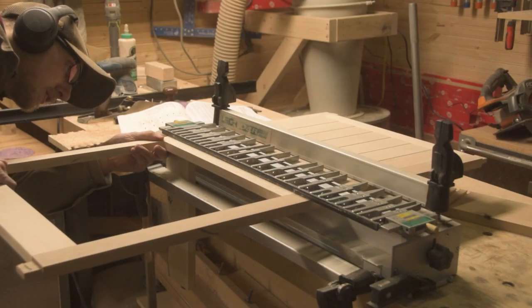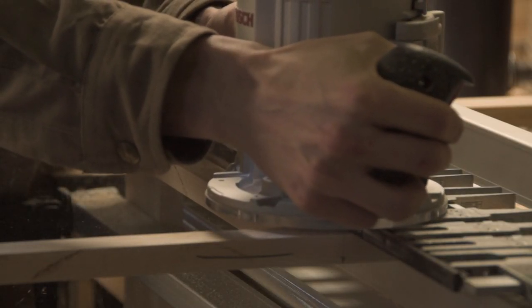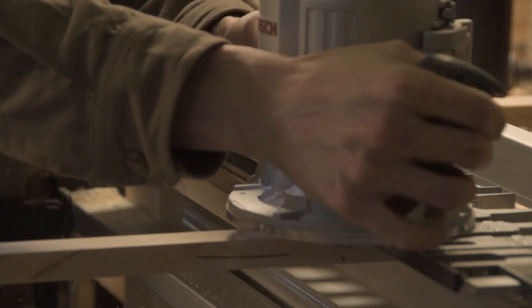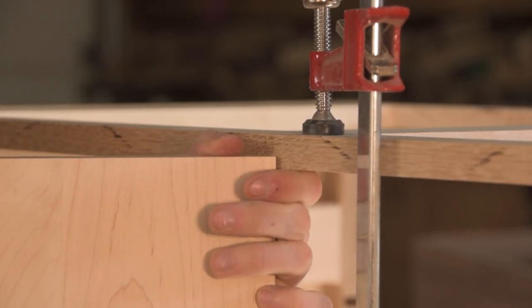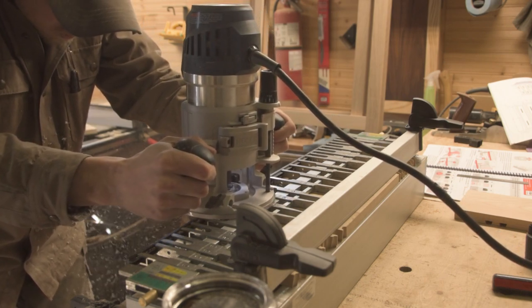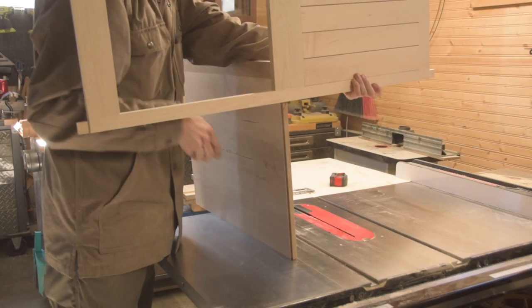It does have the benefit that it doesn't allow these pieces to be pulled apart, for gravity to separate them, anything like that. Now I will say that using this dovetail bit did lead to some tearout, which you will see in the final shots, in areas that I had to do some fixes on. But overall, if I was going to do this project again, I would still use the sliding dovetails because I think that just the strength that they bring into the project is immeasurable. It's way better than any other form of joinery in here.